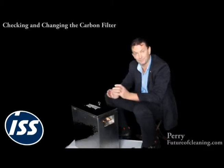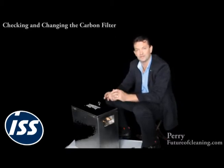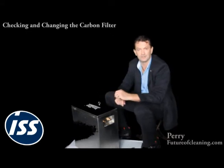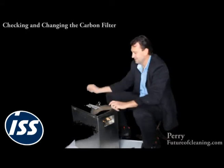Because the carbon filter protects the DI resin from chlorine in the water, and how much chlorine is in your town supply taps will determine how much the carbon filter can protect your system. So let's have a look.